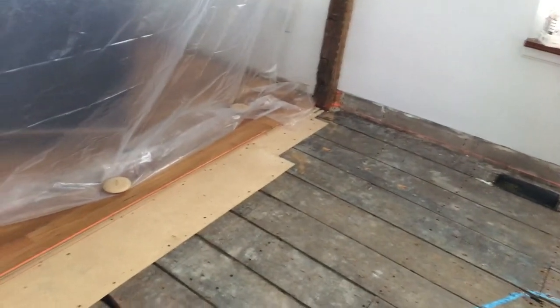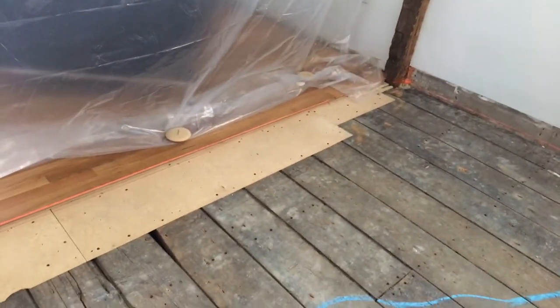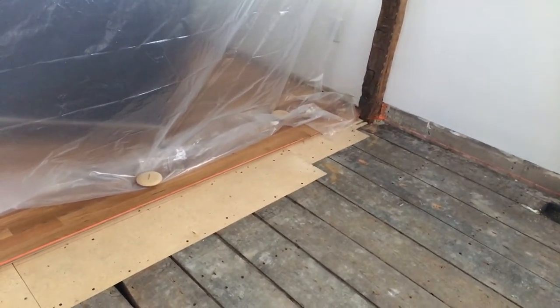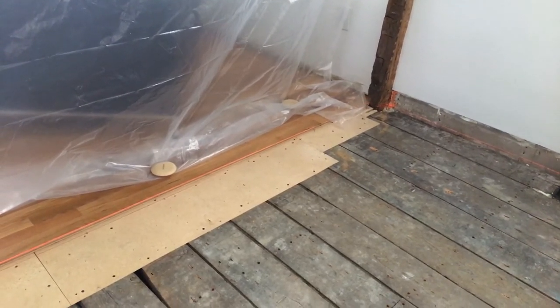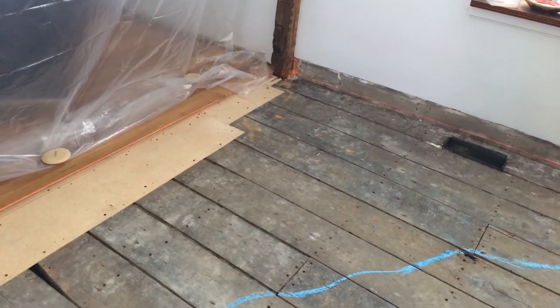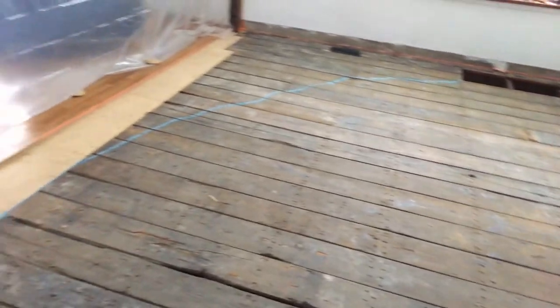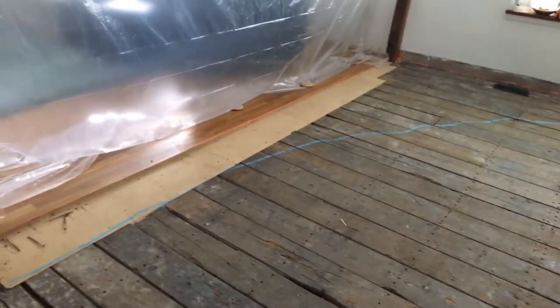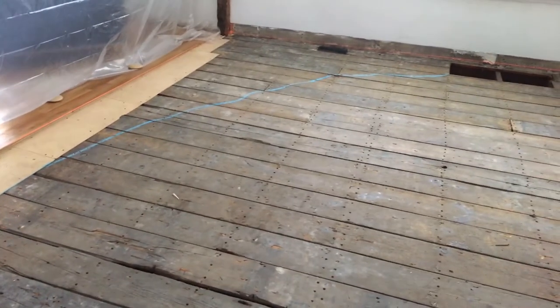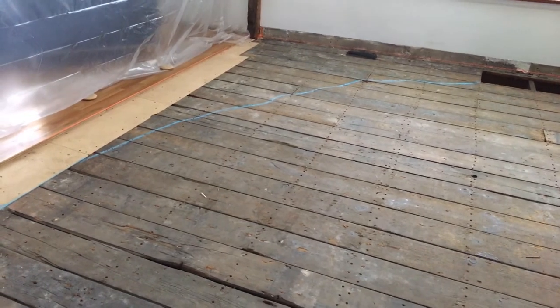I could sand it — I've got a pretty powerful belt-drive sander to sand some material and try to level it out, but I think I can do it with the carpet shims. That's kind of where sistering the joists might be a little bit easier, because you'd be able to take that into account as you go across the joists, remove the floor, and sister them up. That might be where the downfall is to this approach. It's kind of nice having the floor in here with people running around, and I think it's gonna work out. Putting a floor in other houses I've worked on, it's never perfectly level.